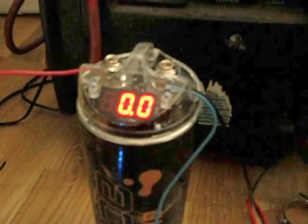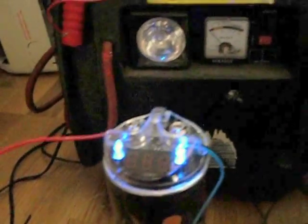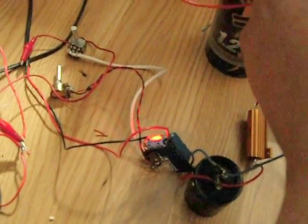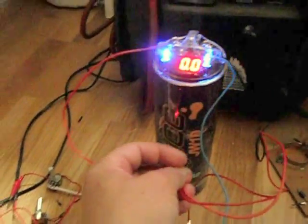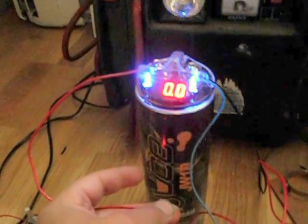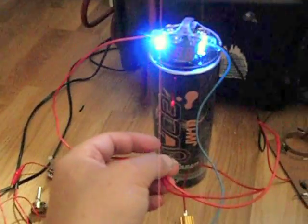And there it's coming up now — that's charging up. That's a one farad capacitor. Now, when it gets to 12 volts, it puts a load on the converter. And the converter takes power at 12 volts, or about 13 volts, and trades voltage for current. So the locomotive gets about 6 volts at twice the current.